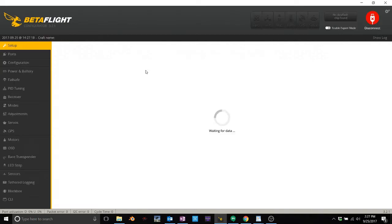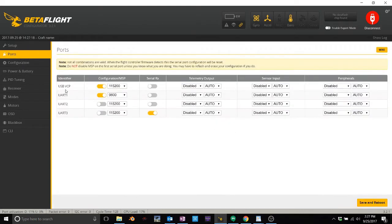One quick disclaimer: if you wire into UART1 and you don't have what's called a virtual COM port - say it shows USB up here and you wire into UART1 - UART1 shares the USB port, so you will have to disconnect from your computer to connect your Bluetooth to have it work. However, most of our stuff nowadays does have a virtual COM port, so most of you won't even have to worry about this. In my case right now I've got it hooked up to UART1 and I still have my virtual COM port, so I can connect that Bluetooth all day long while Betaflight is also hooked up. Very, very simple - I'll put links in the description to the Bluetooth units.